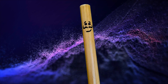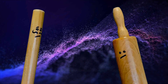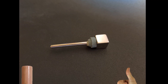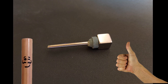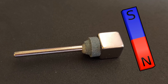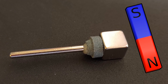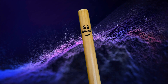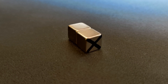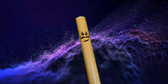So here's how you do it. I used a rotary tool — not a Dremel, a cheap one. I took one of the accessories and glued a strong neodymium magnet as centered as I could to the shaft. I used a cube magnet because it makes it easier to center, and you also need to make sure that the north and south poles of the magnet are perpendicular to the axis of rotation. If you're not sure, just stick two magnets together and mark one of the ends — that's going to be one of the poles. I used a one centimeter cube for this, but bigger is better.